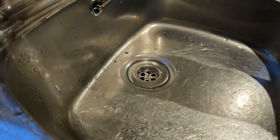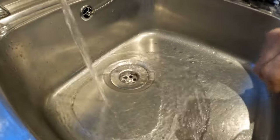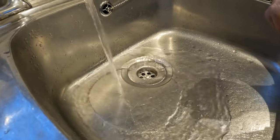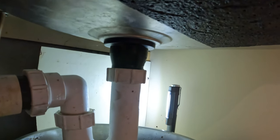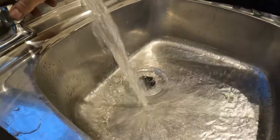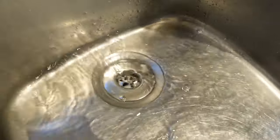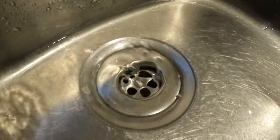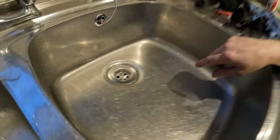We're just going to run the tap and overrun it. Now what we're doing is checking for leaks — we need to wipe every joint. I'm going to fill it all the way up and make sure it can take a rush of water. No drips under here. Loads faster than this morning — no drips.